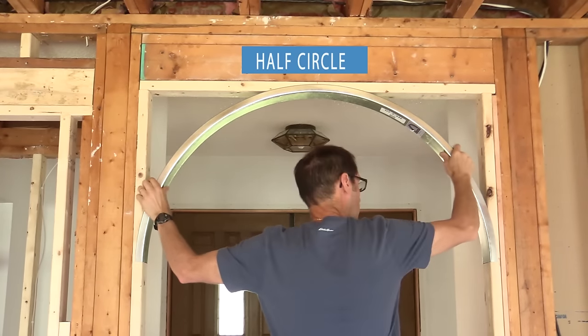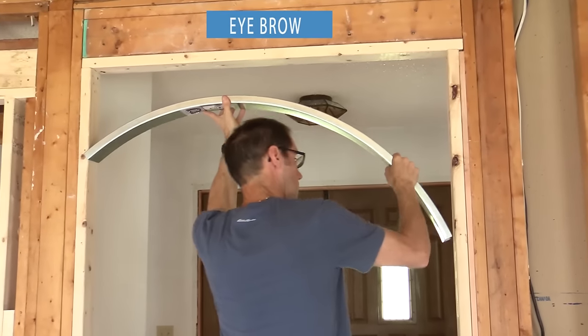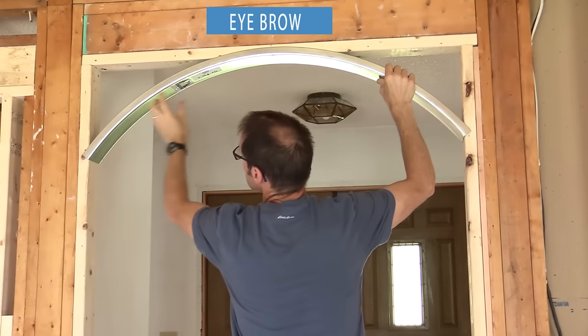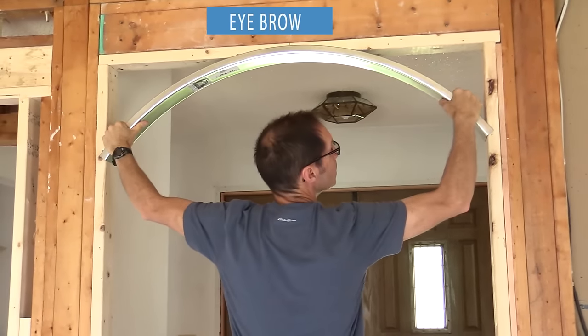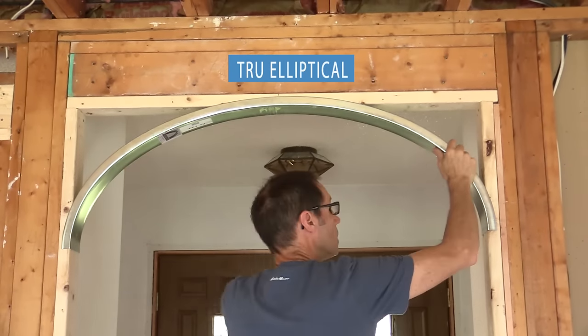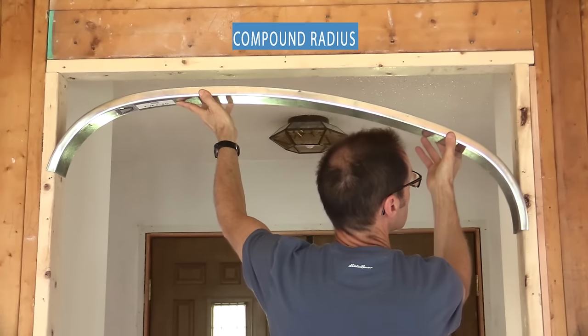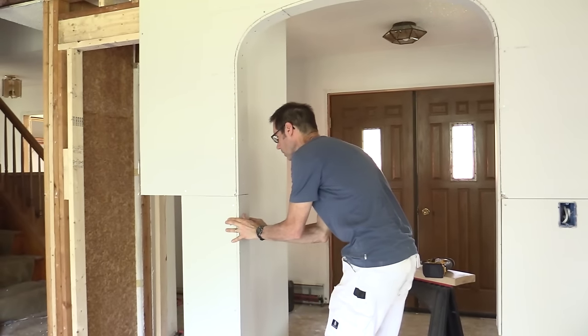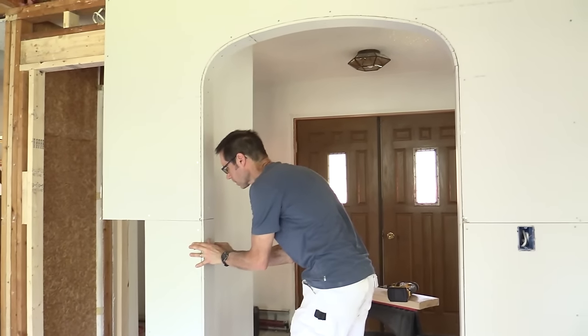You don't have to have a knowledge of how to build an arch or how to lay one out, and you don't have to have all the skills to cut one out of a piece of wood and get everything just right. Because ultimately, when you're going to hang drywall over an arch, if it's not cut out nice and symmetrical, you don't have plenty of areas to attach to, a nice edge to run your router around. You're going to have problems that require extra work as you go to finish and attach your corner to the arch.